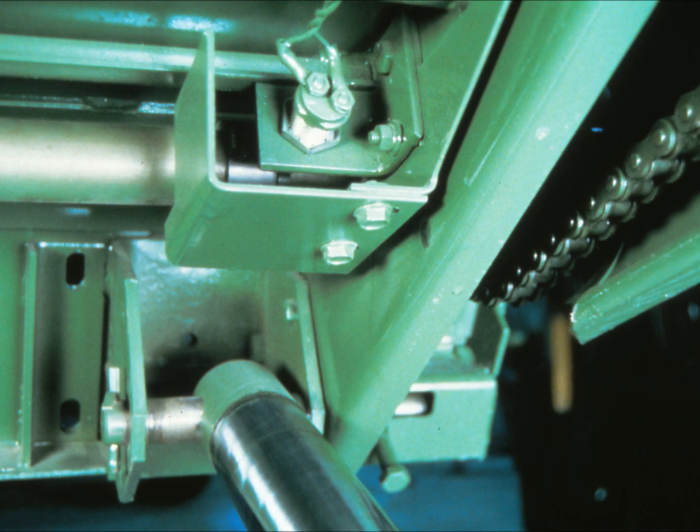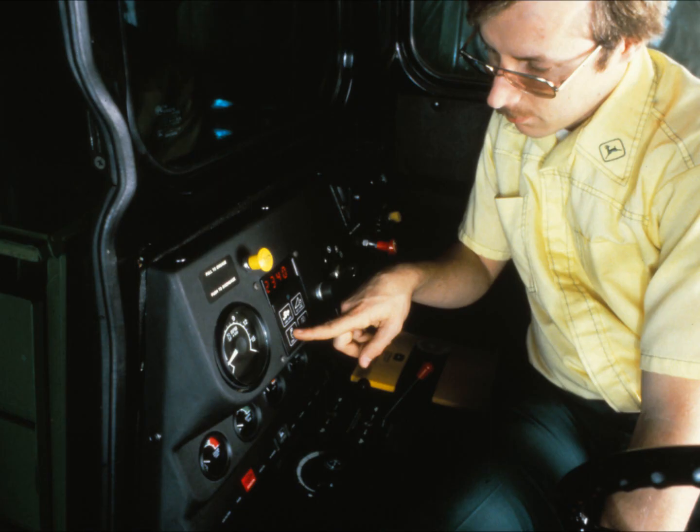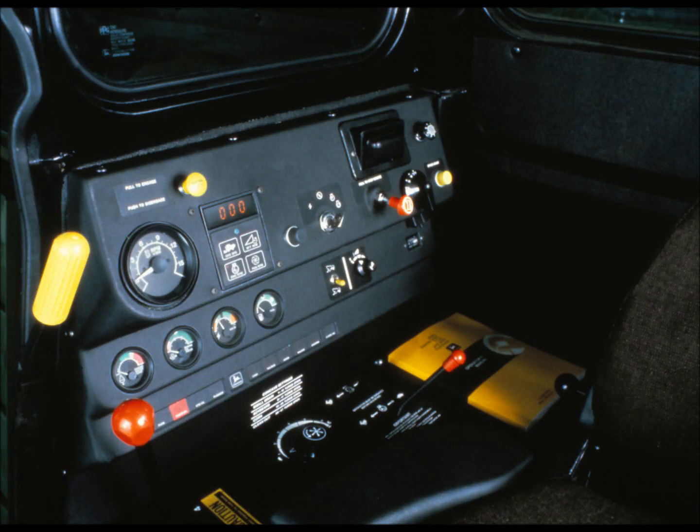Sensors employ minute amounts of energy, performing like mini-alternators, converting this power into electric energy, which is sent as rapid bursts through the wiring network to the digital tachometer, where it is changed into readable numbers so the operator can monitor performance. The digital tach is very readable and very precise. In this program, you'll learn how it works and how to diagnose any problems.